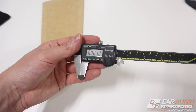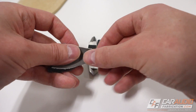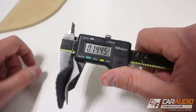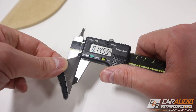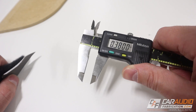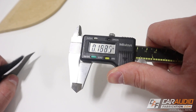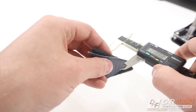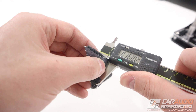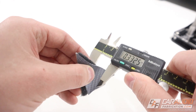Couldn't we just use something like digital calipers? We can just take our two materials, sandwich them, and get a measurement. Well, the problem with doing this — and I've tried this many times before — is you don't really have a consistent reading because your reading depends on how much force you push the jaw together. You can't really get an accurate feel for how tight that gap is going to be, and you end up with gaps that are far too tight or far too loose.